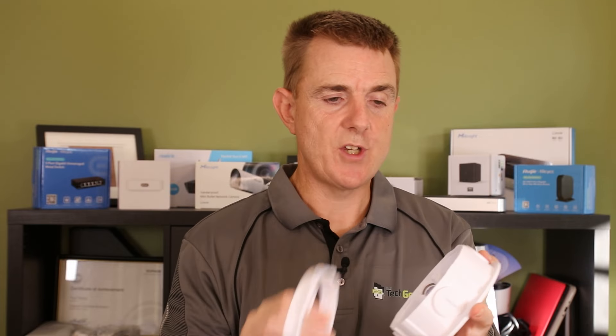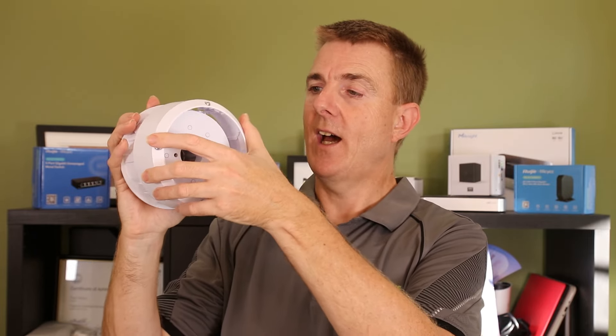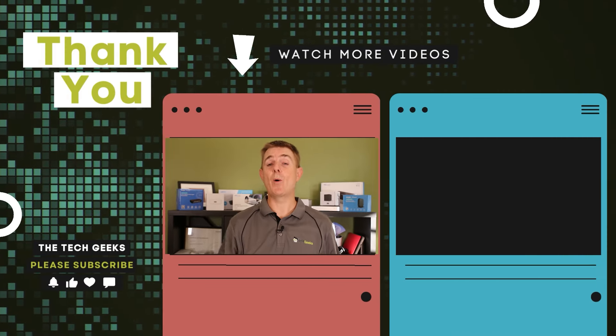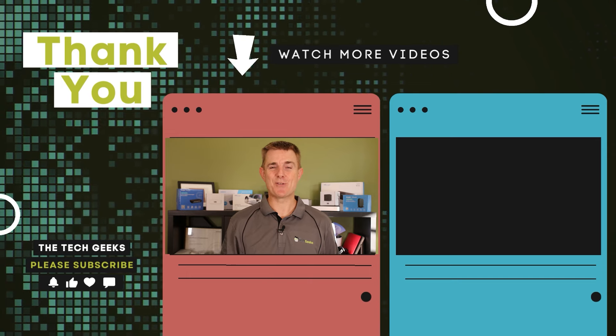So just to remind you: where you've got dome models — not the dome ultra, because that's too small — a G5 dome or G4 dome will fit inside, bolt to these pieces here, and then you can push that cover over the top. There is a compact version of this as well, which we'll hopefully do a box opening on very shortly. If you are wanting a full junction box with secure mounting — this portion is metal, the rest of it is plastic — that's ultimately what you're going to end up with fitted together. This is the UACC camera junction JBW — the junction box for the camera in white. Head on over to our YouTube channel for plenty more box openings on network, firewall, and wireless, how to run UniFi Protect or UniFi Network, reviews on the cameras, and more. Why don't you subscribe and stay up to date?